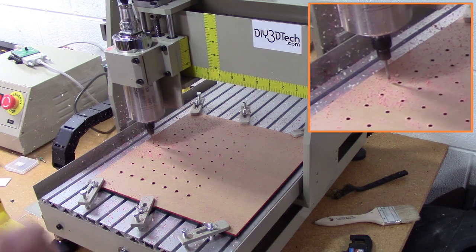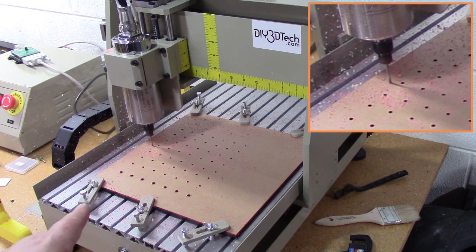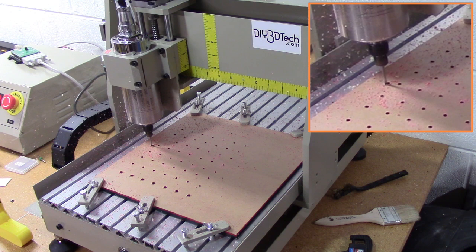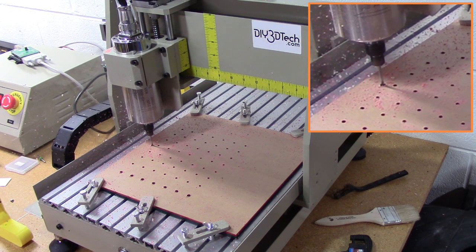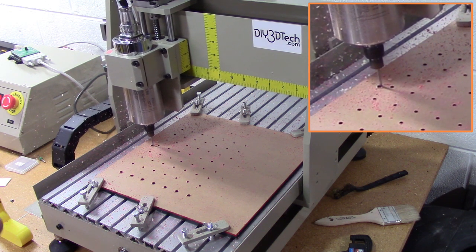This thing has just really been great. This is a three millimeter acrylic that we're cutting with a two flute. Some of the initial cuts obviously when it hits the material it's running a little bit louder, but I'm just really impressed.